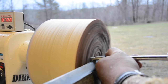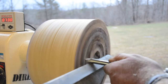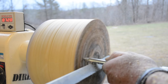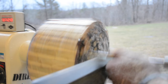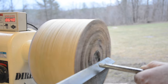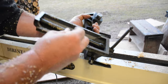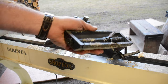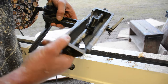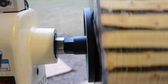Now here I had a little issue. I'm cutting that end grain, taking a very slow approach — and then watch. The chisel grabbed one of those end grains and broke the chisel perch right in half. I have that big cantilevered edge which I was a little suspicious of when I first got it, because I was worried that something like that could happen. I didn't feel that same sturdiness you'd feel if the chisel perch was supported directly underneath it. And then the plate bent too — a double whammy.